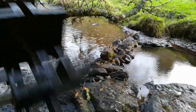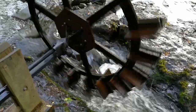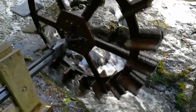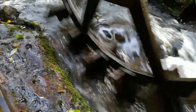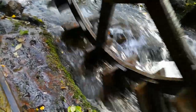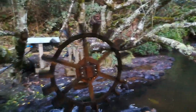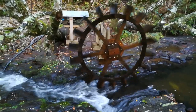We also dammed up the river a little on the far side, where water was draining off, just to allow a bit more water to pour down this natural weir and guide it. That really helped. We also widened the fins — before I just had some folded tin about 150mm wide, and now the fins are about 300mm wide. We widened the weir channel in the bedrock by just a few centimetres to accommodate the bigger fins, and it's now form-fitted to them. It's been ticking along doing its thing for a few months since we added those bigger fins.